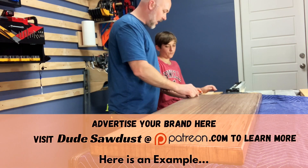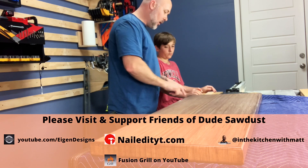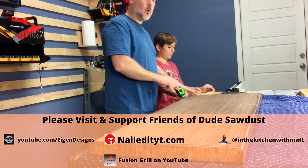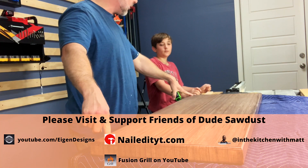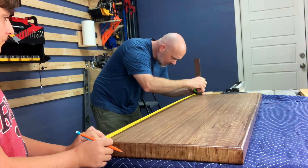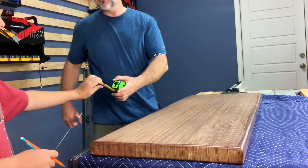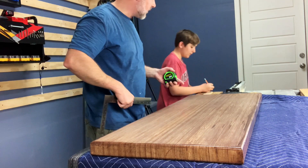The legs are one and a half by one and a half, and they're going to be a half-inch offset on the corner. So if you have a half plus a one and a half, that's two. Over here, same thing — two inches here and two inches here, so two plus two is four. We've got forty-six and five-eighths total, so forty-six and five-eighths minus four is forty-two and five-eighths. So the piece is going to be forty-two and five-eighths long.